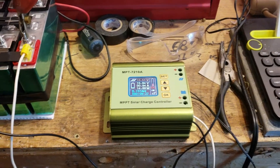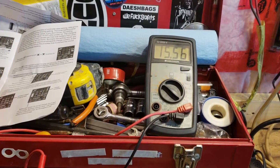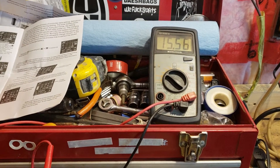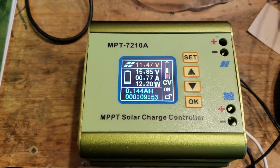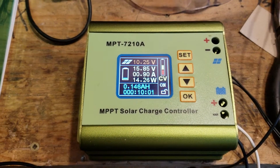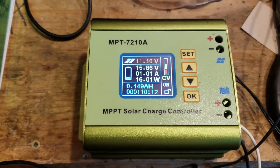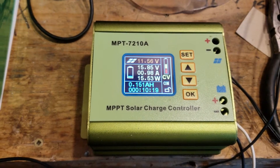My 4S pack is charging up to 16 volts — we're just around 15.56, 15.7. This little thing is working. It just switched into its constant voltage charging mode where it keeps the voltage the same. The battery charge indicator doesn't really tell you what's in the battery so much as what you've put into it, but it does kind of work. There's a little gauge on the left where you can see your voltage coming in.